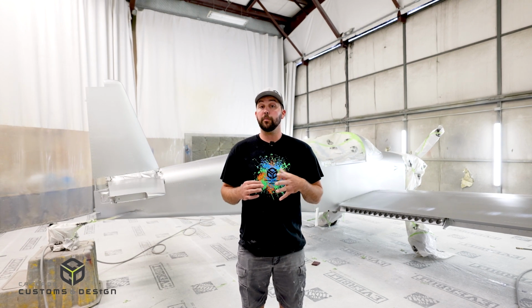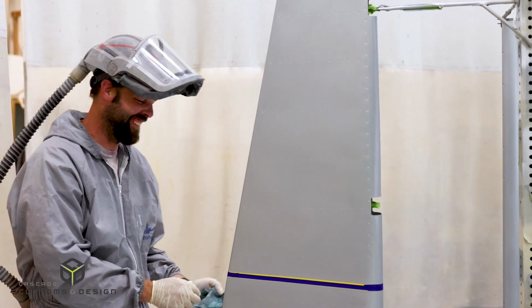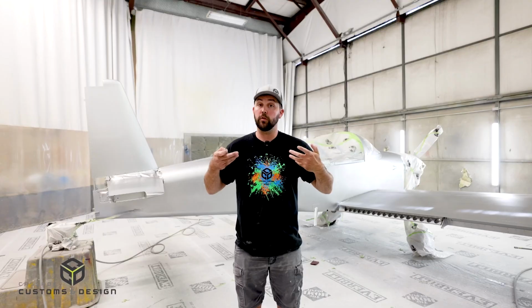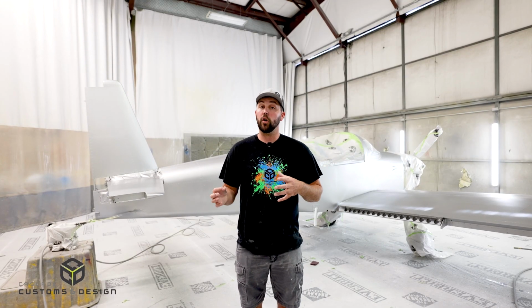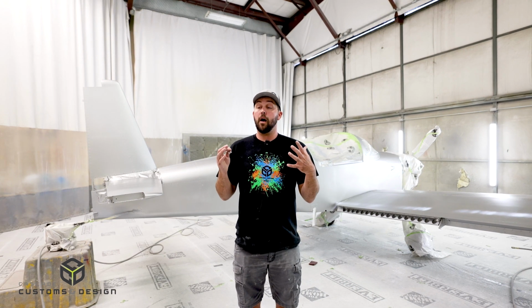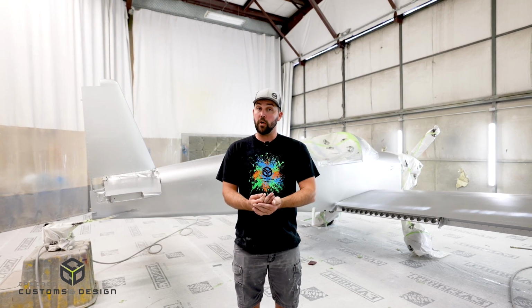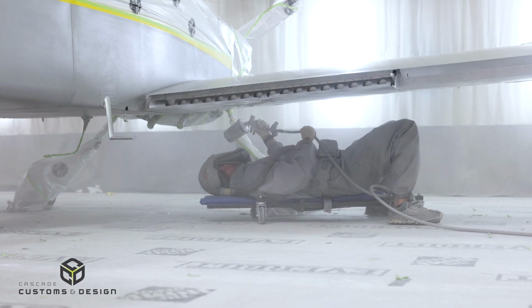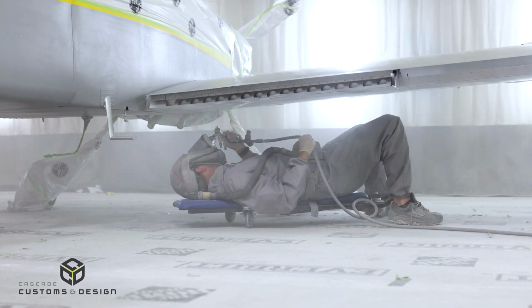The first paint we apply is a tinted primer sealer. This locks everything out from that layer and underneath, so things can't leach back through or have any transfer issues. It also helps with adhesion and makes a better bond for the whole paint process. Once that color build is on there, we jump into all the colors. The first color we are selecting, based on your paint scheme, is silver. So the silver's on here.